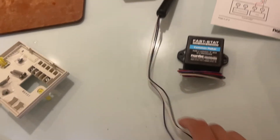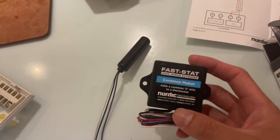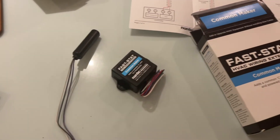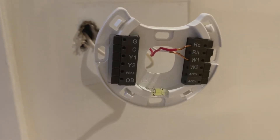This sender will attach to the thermostat, and then the receiver would most likely attach to your furnace or whatever you have in the garage that heats your house. The C wire will need to run from the thermostat to your furnace or whatever powers the heater. To figure out where that is, I followed the cord down to the corner and stuck some metal wires through to check where it came out. I'll walk down to the garage now to show you where it's at.